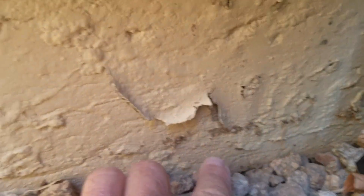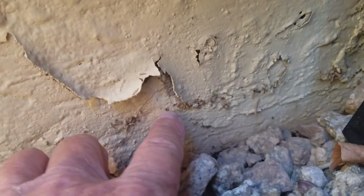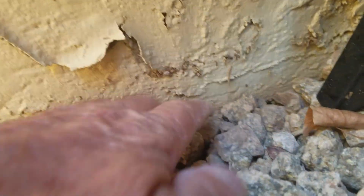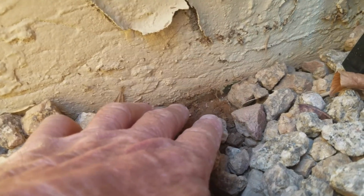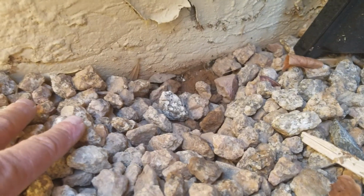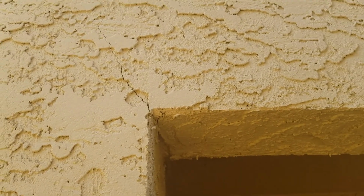And this is where the water line was. This is some real light material that floats on top of water. So, and this is, maybe 3 inches up here. So there's 3 inches of water next to this home, and it saturates down. It only has to go down another 12, 13 inches or so, and the soil's holding this side up. So if this side is moving, we'll have these vertical breaks, and we will get a separation at the weakest joints, doorways, windows, and thresholds, which is indicated here.